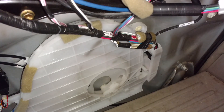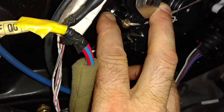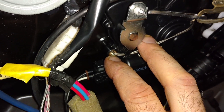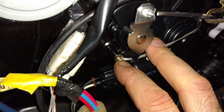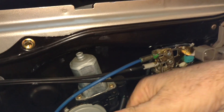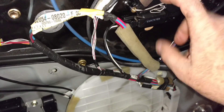Another observation: that little metal insert only goes maybe three-eighths of an inch into the plastic — not three-quarters — so you don't need such a long drill job. If you get about one-eighth of an inch in, it may be enough to remove the Loctite and heat things up so you can unscrew it. You can also unscrew all the screws around the door panel, roll your window halfway down, take off the slack, and reach back behind there with a right-angle number two Phillips screwdriver.